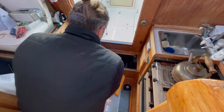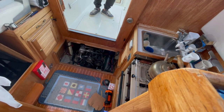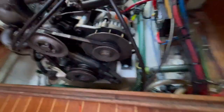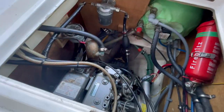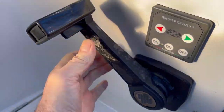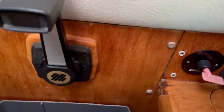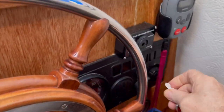The first bit's easy — you've just got to find your engine. I like to open everything up so there's as much accessibility and as much light as I can use. My oil filter hides around that side of the engine there. My gearbox hides around the back with that yellow plug in it there. And the engine dipstick hides under the side just there. The first thing we'll need to do in order to take the old oil out is warm it up — get it nice and warm, get all the debris that's down there suspended in the oil so it can all come out with it.